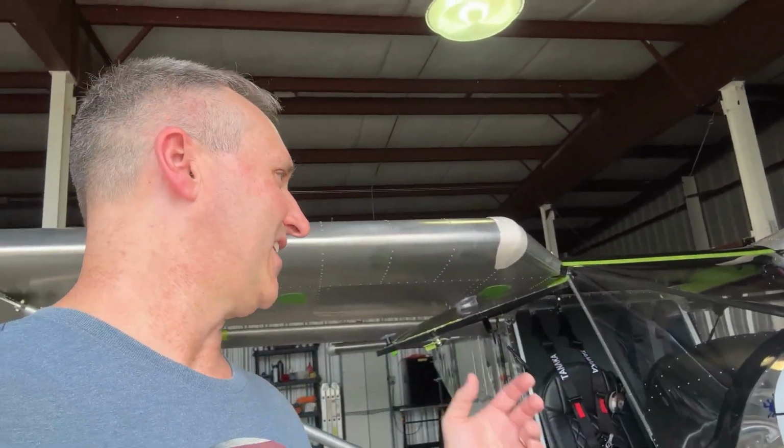And anyway, that runs at 9600 speed, so it's different speeds. Long story short, that EIS can no longer read on my EFIS screen. Take away the pins, or take off the connections from the Safe Fly, dig underneath the panel, take out the pin, put it on a different pin, then put everything back together, and it should work just fine at a slower speed. But that's going to take a lot of work, and it's super hot out here. So I'm going to try to at least get started on that.